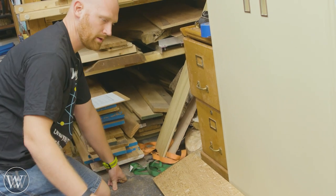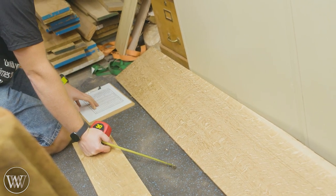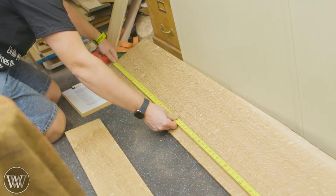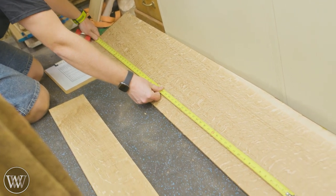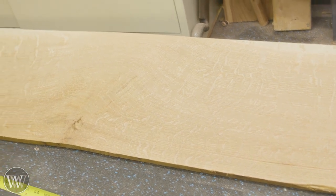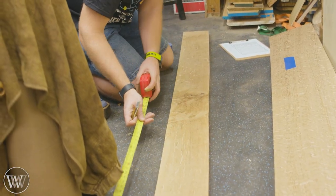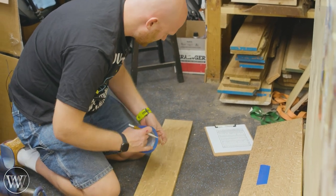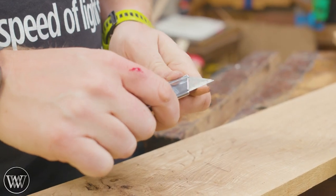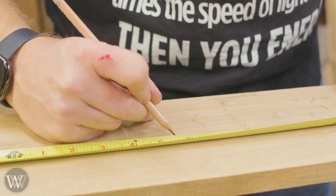My tops are going to need to be ripped out of that. I'm going to need double the length of each one — so four foot eight inches for the main top. I've got three foot so I'll make that work in there — my tops can come out of that. Then I need the stretchers. I'll get my main stretchers out of this one — one foot five. So that will come out of this one. It's a foot five, so I'm going to mark it — put it at five and a half.